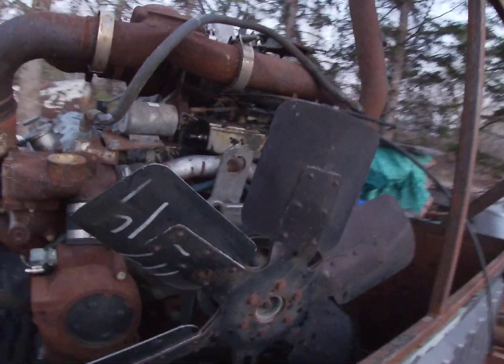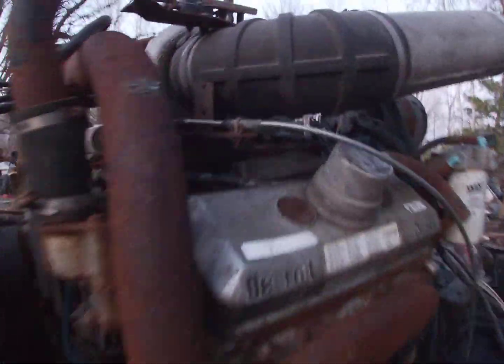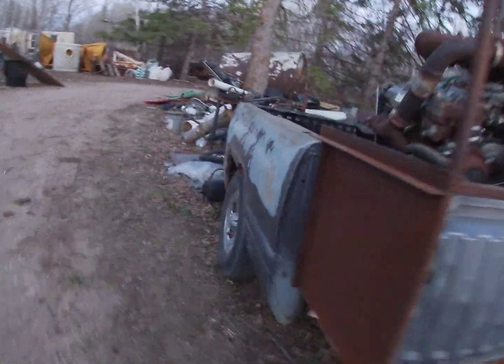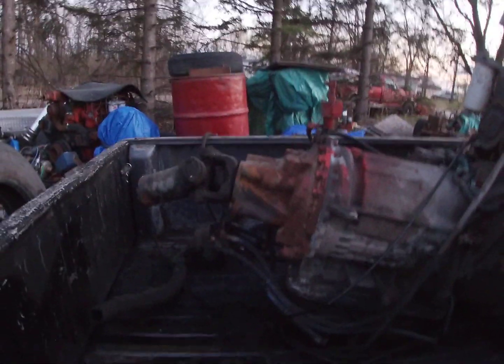It had an electric shutdown on it. I didn't see any Murphy gauges in this thing. And if you can see up in there, that is an air governor or air throttle. That's for the high idle when the PTO is on. I'm going to leave all this stuff on. I just went on the internet because I didn't know a lot about this, and I was asking. That's how I found out what all these lines are.